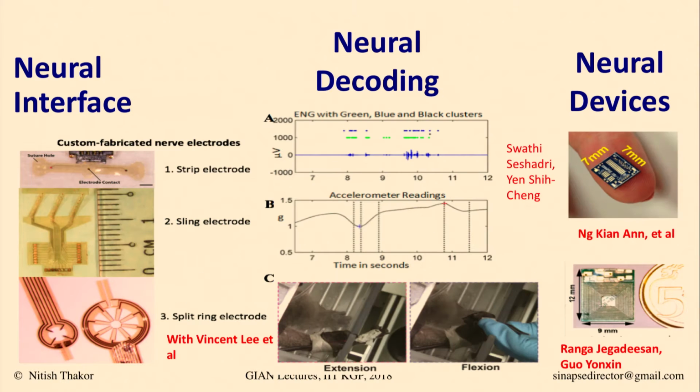Okay, so we'll talk about implantable micro neurotechnologies. I'd shown you some picture like that before, but anyway, what you see here is a small microfabricated device, MEMS fabricated, which stands for microelectromechanical systems. The technique is to make things at a very small scale. For example, each of these little probes might be 100 micron, and the entire thing might be 1 or 2 millimeters. Nerves are about 100 micron to less than a millimeter, and so it can go around them. It's also flexible.